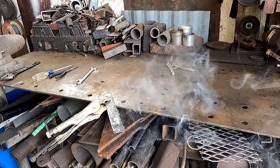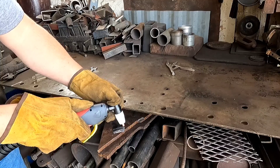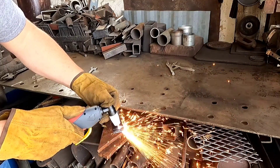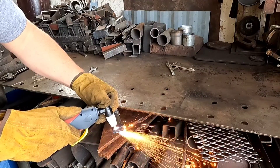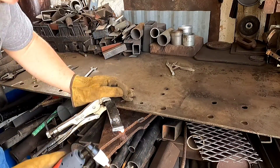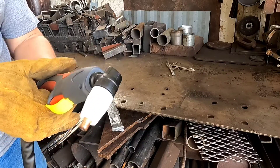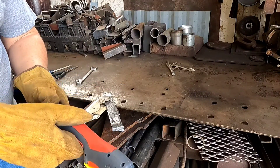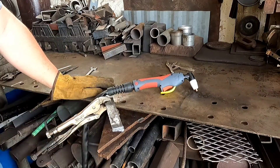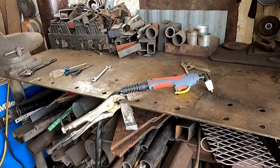Let's try and turn that up to about 40 amps. It doesn't seem like it cut all the way through real well, so we'll back up a little bit right beside of it. Look at that. That worked out good. New end's good, I like it. At least I think I do. That feels a little loose, but it's a swivel ball — maybe it's just made that way. There's how you fix your lead on a cheap plasma cutter. We got that one for free.